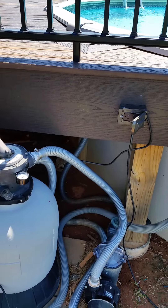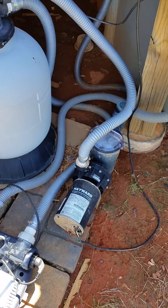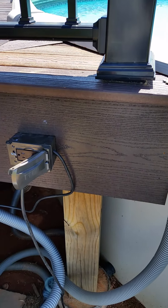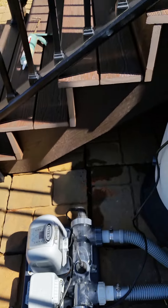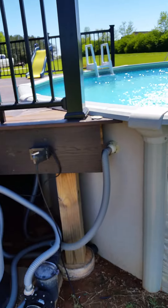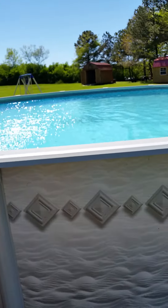So the point of this is: bypass this little doohickey — you might think you have to go out and buy a new system, but you don't. If you have a receptacle outlet by your pool, hopefully it's a GFI-type circuit, just hardwire these devices in. My pump doesn't have an on/off switch, so I'm going to hook up a toggle switch to turn it on and off. That switch will also turn off the saltwater system, though the saltwater system has its own on/off switch anyway. Just a little video to help folks out thinking they need to buy another Intex saltwater system — it's really not necessary. Thanks, have a good day.